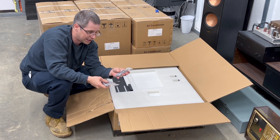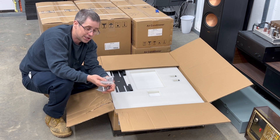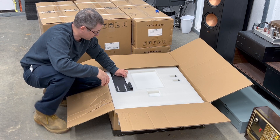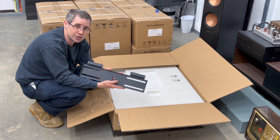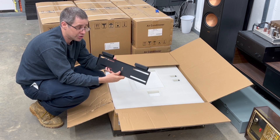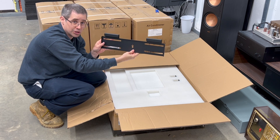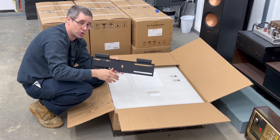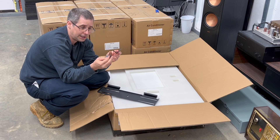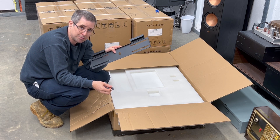Next you've got different bolts to hold this into wood studs, or if you have concrete, here are your anchor bolts to anchor it into a concrete wall. This is the top bracket that you use to install it. The arrow faces up — you put this on your wall using the template, secure it, and then your EG4 12,000 XP sits on this. For the bottom, there are two small brackets that hold and secure it, but all of the weight is going to be squarely on the top bracket.